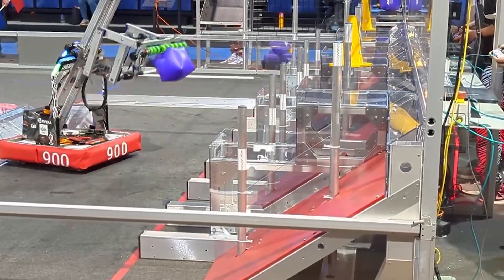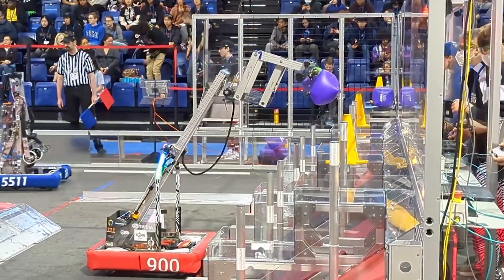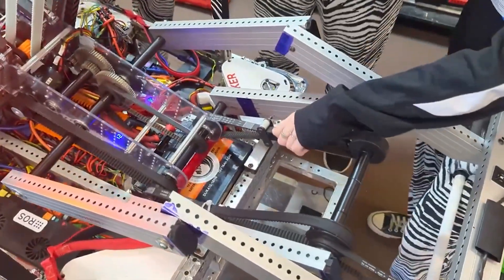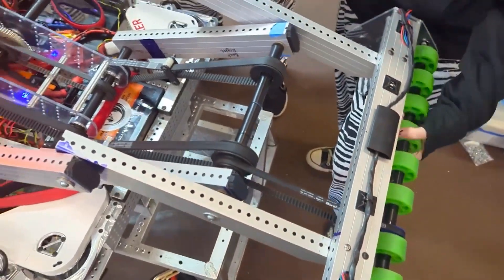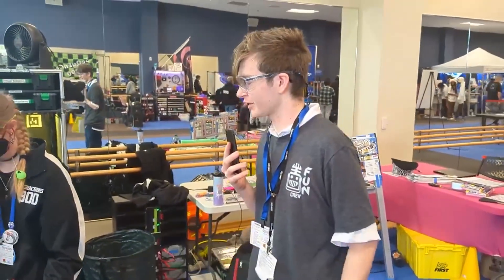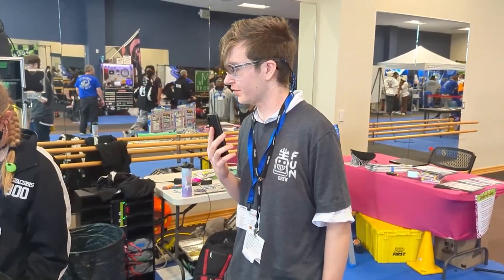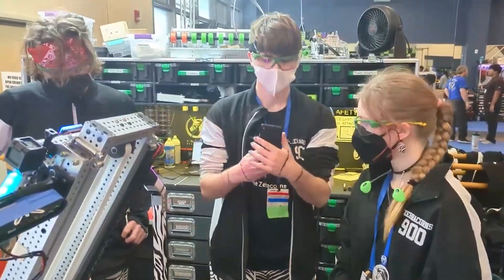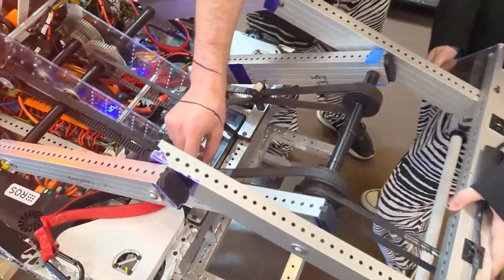The arm is what we call our four-bar. It is run by two Falcon motors, and all of it is run by these belts here, so that they all move together. We actually have a very sophisticated solution — it's called a zip tie — on these belts. We recently had to deal with belt tension, but what you're really more interested in are these custom tensioners.